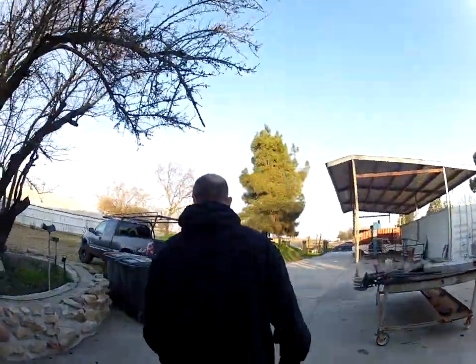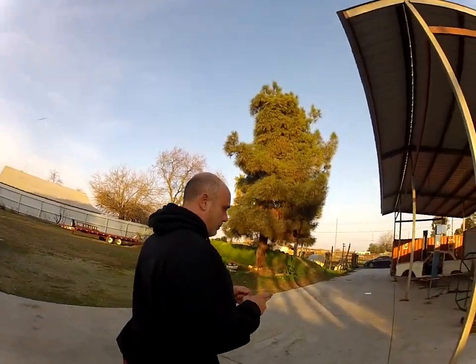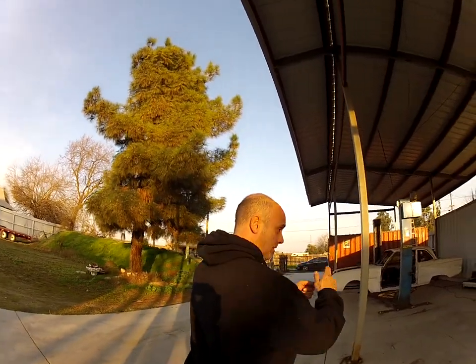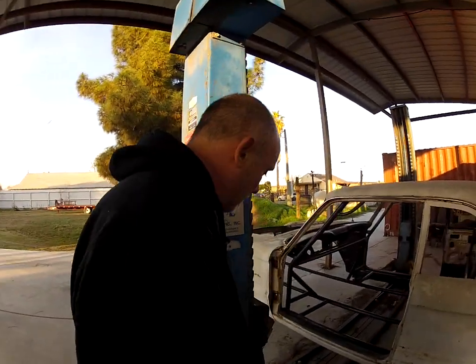I've actually learned to weld chromoly. You always joke about welding that. You don't do second passes on chromoly. And the filler rod, every time you stop, you've got to cut the end of that filler rod off because it oxidizes the end. And the moment you start with it again, it jacks the weld up.